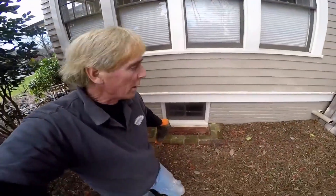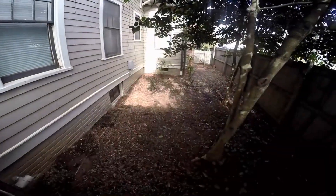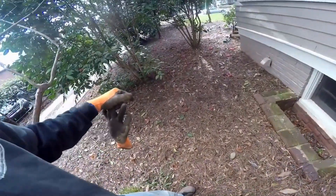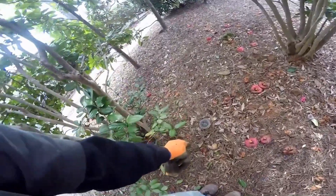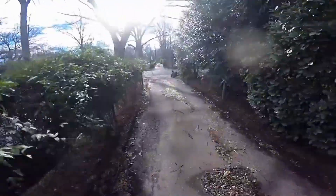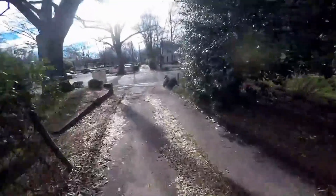You can see the basement window here. This downspout here on the alley side has lots of downspouts that hook onto this line. Those lines come down through here, and if the downspout drain backs up, it ends up right down in that basement. So we've added a clean out here over the years to have access, just in case. The line runs all the way down to the end of the alley — it's about 200 feet long. We have just enough cable to get through this line.